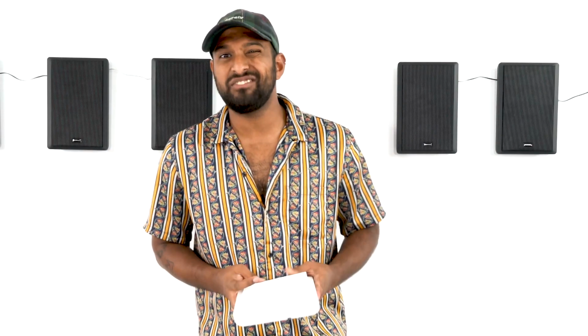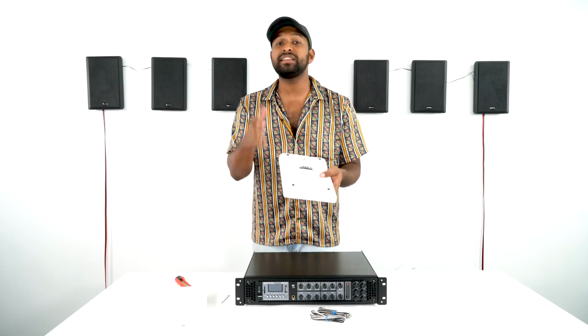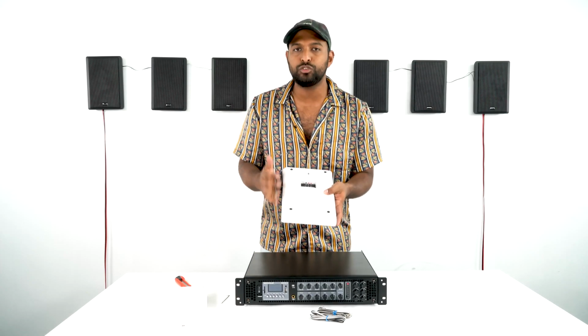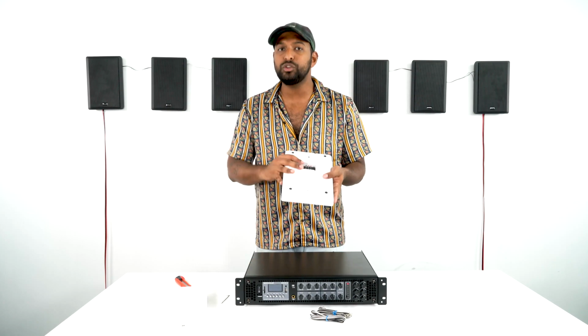Now before I go ahead and play something, let's talk about 70 volt. We have a great video on our YouTube channel called What is 70 volts, where we go over all the things like wiring, the advantages, and how easy it is to use 70 volt. Since the Rockslim are a pair of 70 volt speakers, I want to show you something called a 70 volt tap. Now what a tap does is it allows you to change the amount of watts you are drawing from your amplifier to your speaker.